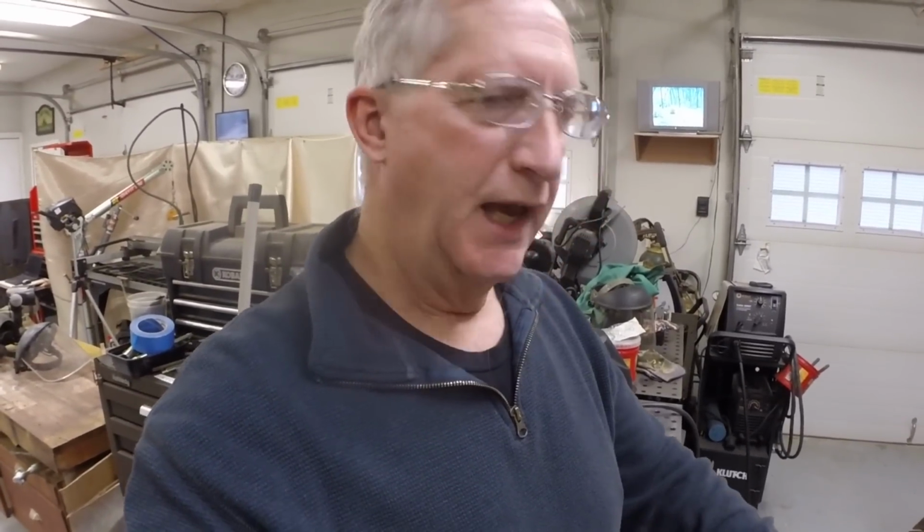It's really done for two reasons, but the primary reason was ground clearance. I don't have much ground clearance under the bottom of the tractor, so I needed to raise the tractor up a little bit, and the only way to do that is larger diameter wheels, which would be out of scale then. So what I decided to do was just let the tractor ride on the bogies, push them down a couple inches, give me a couple more inches of ground clearance, and what it did, it lifted those wheels off the ground. Well, the second thing that does is it also takes stress off those axles.